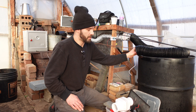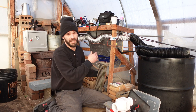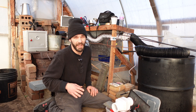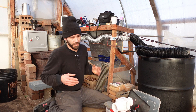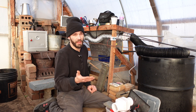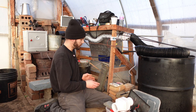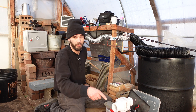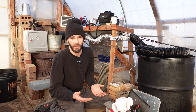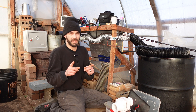So this was a cool experiment, but I want to reroute this to my geothermal tube. The thought behind that is this gives me access to underneath my greenhouse floor — basically eight foot down. I hand dug and ran this tube — we've got like 70 or 80 feet in there. In theory, if I can use our floor as a giant heat battery, I want to gradually transfer BTUs from my stove down to the floor eight feet down. I might not see any immediate results, but I want to try this out.